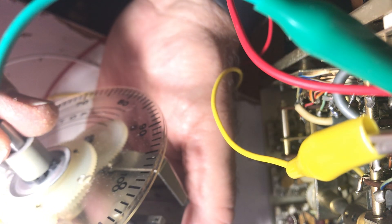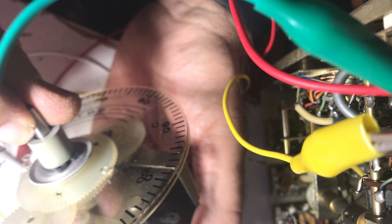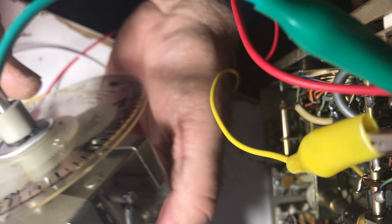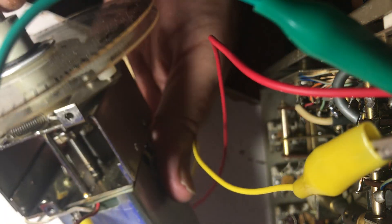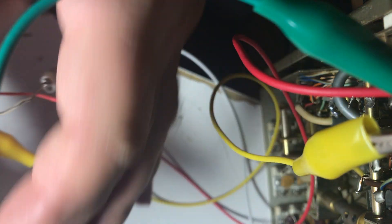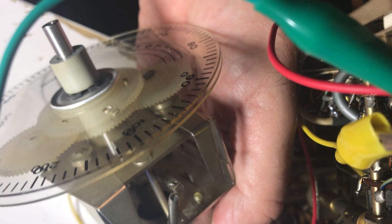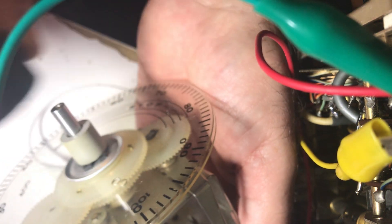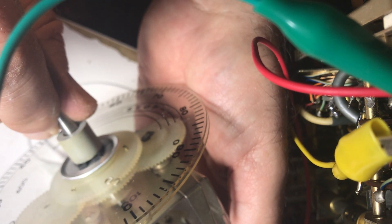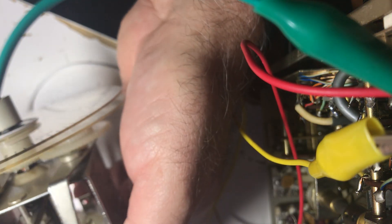Why am I getting a beep here? I'm on 3.6 - okay, that's good, so we're very close and now we're netted. So that's how to do it. Let me check what frequency I'm on - I'm showing 3.6 exactly. Pretty much. I took the knob off and I'm rotating this now for zero beat - and that's it, it's done. If you get it close, that's what you can do.